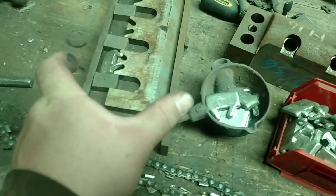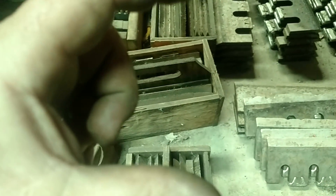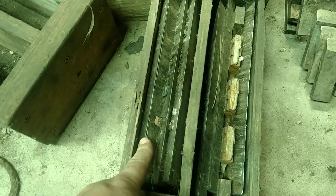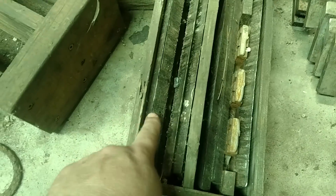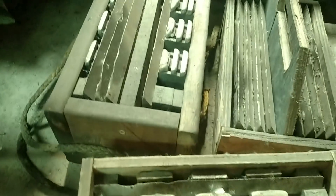To keep that knife sticking out of the drum the perfect amount. We have these little carrying cases because you really have to keep eight knives together as a set — they all have to be sharpened the same, with the same amount of babbit on each one. Otherwise it'll throw the chipper out of balance. I like to put the dull knives in upside down so you can see that, and this knife shows you how much babbit is on there to show how old the set is.